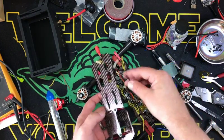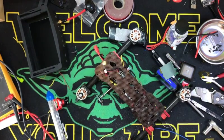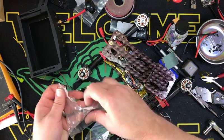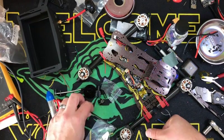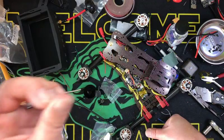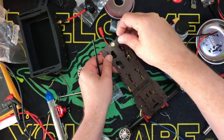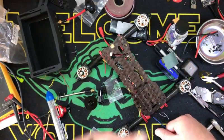The next thing we need to do is our GPS rig and we got to find our stand for that. I'm probably going to bring it out the top. So here's our GPS stand. This is way too long — I'm going to cut it down. Usually GPS modules will not work on the frame. I've tried it on almost every GPS build I've ever done and every time there's motor interference and it goes crazy. So I'm going to cut it off at about there and mount the GPS. Can't be too tall. I'm going to do this — be right back.